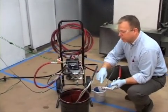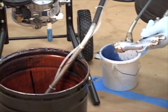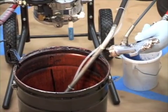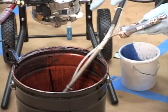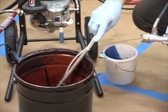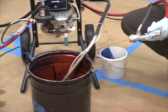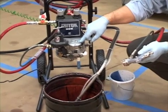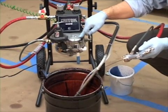I'm going to pull the trigger and look at my stream. Right now I've got an inlet pressure of about 25 psi on my pump. I'm going to increase that to about 40, and then start increasing my regulator until I get the paint stream I'm looking for. There's a little bit of air still in the system — that's why you're seeing the fluid stream go up and down. Now I've got a paint stream coming out approximately six to eight inches and then breaking away, so I'll give it just a little bit more. Now we've got something about eight to ten inches and then it's starting to break away. My fluid pressure is about nine psi, so that's a good setting.